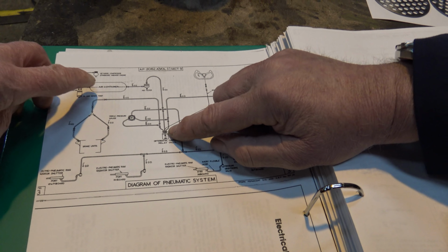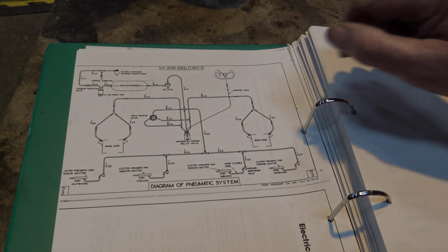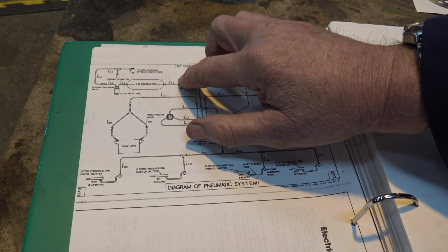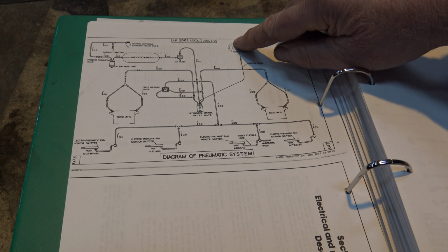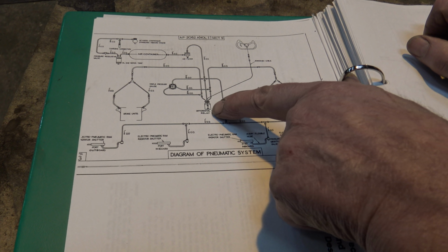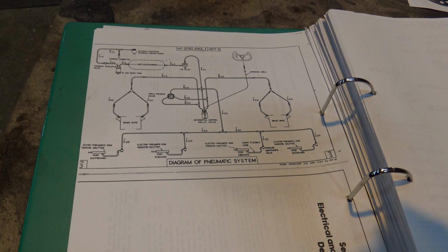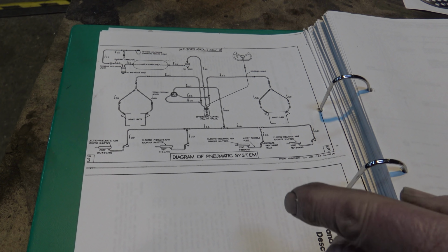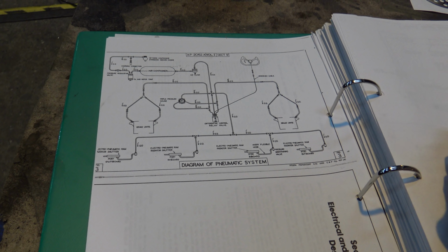See, this air pressure bottle, that's just in front of the pilot, isn't it? That's right, it's between the back of the nose turret and the front of the instrument panel. Yeah. And that's his brake operating cable. Yeah. And then you've got a connection on there which goes to the rudder bars. So as the pilot moves his rudder, if he only moves his left foot forward slightly, you'll only get, for argument's sake, 40 psi. I see, yeah. And so it's a differential braking system.